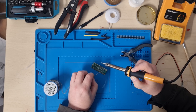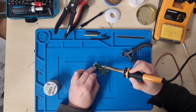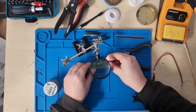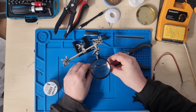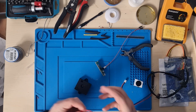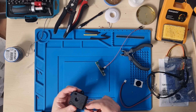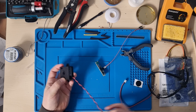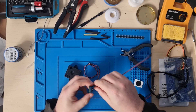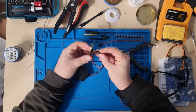You can find a lot of good places on YouTube to learn how to solder. This is the HD clicker — it is made to make hard drive sounds based on the activity LED output from the motherboard. But we need to connect it to the Raspberry Pico, so we add a cable from this port and then connect it to our new port on the Raspberry Pico.